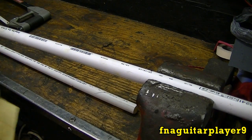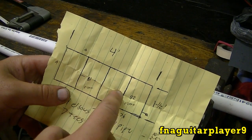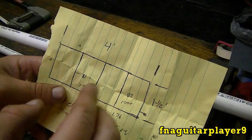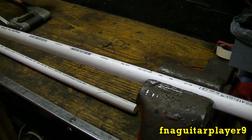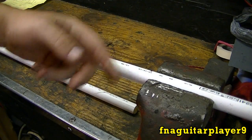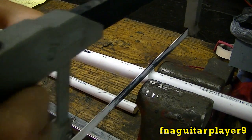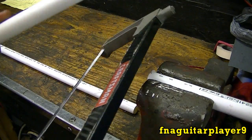I've got a piece measured off at 11 inches, and these are going to be spaced one foot apart — one foot, two foot, three foot, four foot, like this. Since you've got to allow an inch for the T and a little bit of space for the elbow on both sides, I'm cutting these at 11 instead of 12, that way it should come out close. There are several different ways you can cut PVC pipe — I'm just using a hacksaw. I think a hacksaw is faster for PVC; you just got to make sure you're doing it straight.